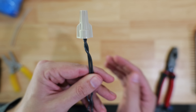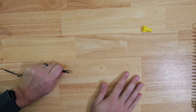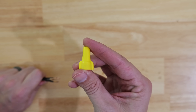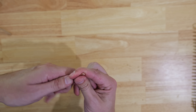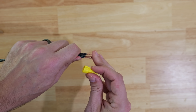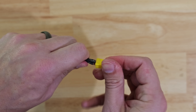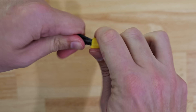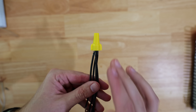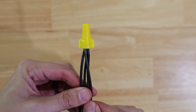This next mistake is one I see almost all the time: using the wrong wire nut for the job. In this case I've got a yellow ideal wire nut and four number 12 wires. What somebody will do is take wires that are too large and in too great a quantity for the wire nut they're using, but they'll somehow find a way to shove all those wires up into that wire nut. We've got all our wires in and nothing's just falling out, but I can guarantee you this wire nut is way overloaded.